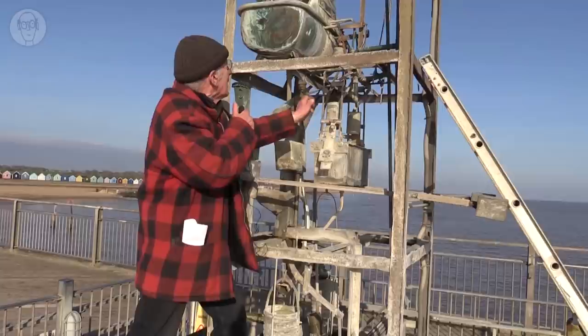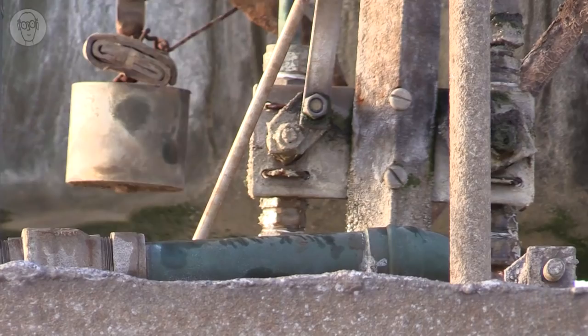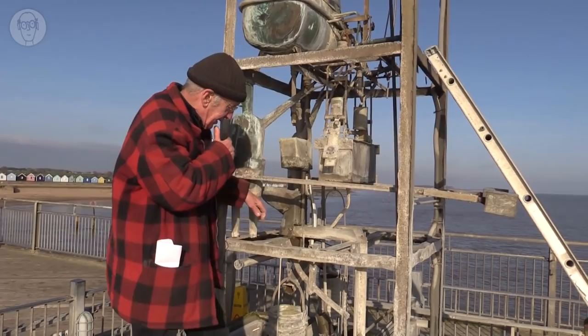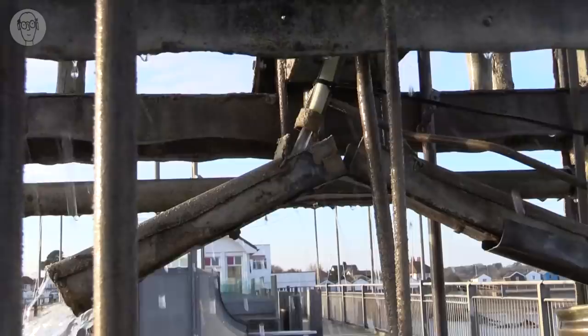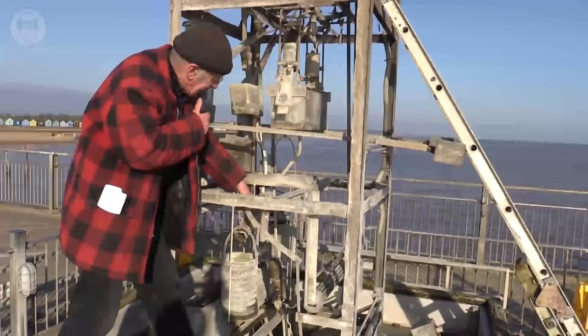And in addition to that, there's an extra little lever in there that rotates a tap to make the water come out of their mouths. So you've got all that going on, and then for the finale, what I should have said is that as the flowers pop up, there's an extra lever around the back here that moves this hose. So it moves it from one side to the other. So instead of the water coming down here, it goes into the can at the back there.